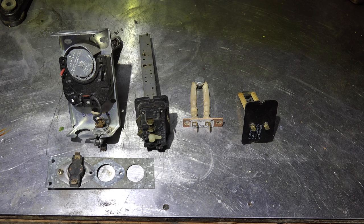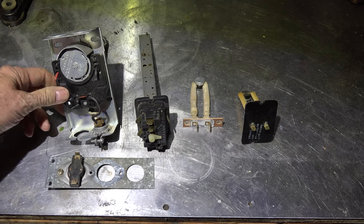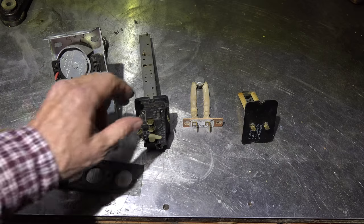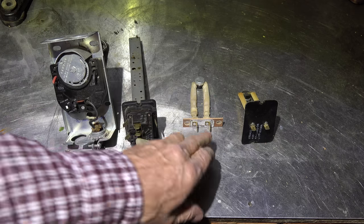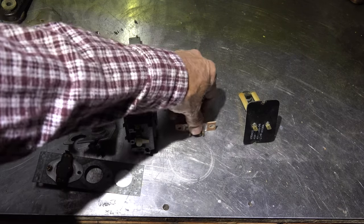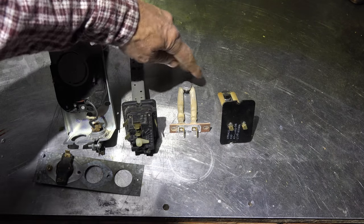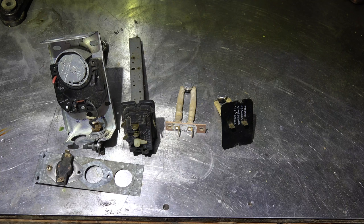Here I'm showing a bunch of limit switches. This is an old style from a furnace built over 30 years ago — a combination fan and limit. There's a little button-type limit switch, here's another one with a probe, and this one also has a probe that fits inside the ductwork. These two are newer styles used in somewhat newer furnaces, and the switch is placed in the airflow to sense temperature.